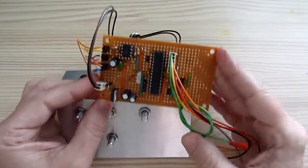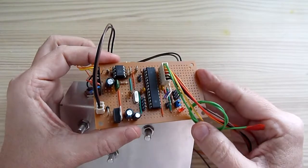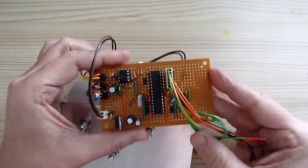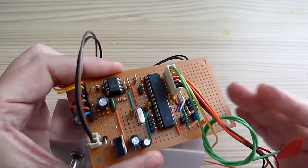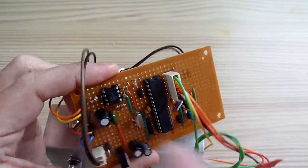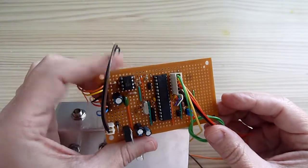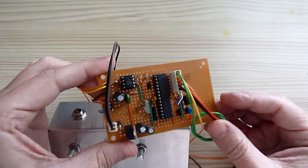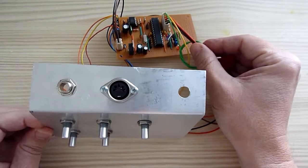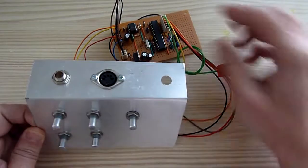So here's the synth. Even though it doesn't quite look like it, it really is an Arduino — a standalone circuit that allows you to run Arduino code without an actual Arduino board. It's got just the very basic components: microcontroller, crystal and ISP connector, some header pins, and an optocoupler for accepting commands via MIDI. This is a four voice polyphonic adaptation of the Arduino synth that runs on MIDI, hence the optocoupler circuit. I have to play it using a MIDI keyboard.